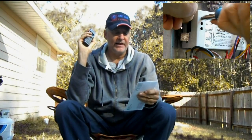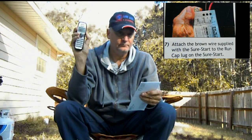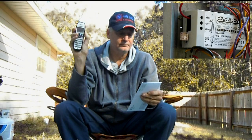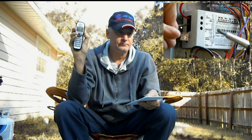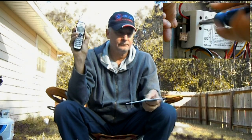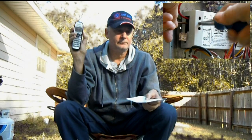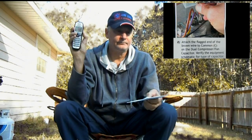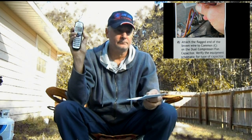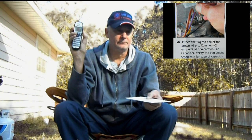What's the difference between a hard start and a soft start? A hard start basically is a capacitor — it stores up enough power, but what it's really doing is still shocking the motor when starting. The biggest problem with hard starts is that starting the motor is when all the windings heat up and start burning up, which decreases the life of the motor and compressor.